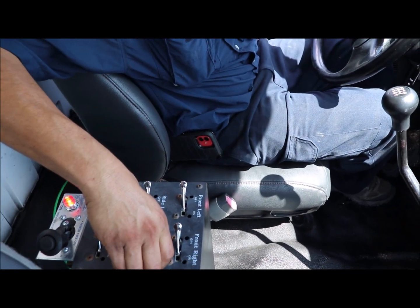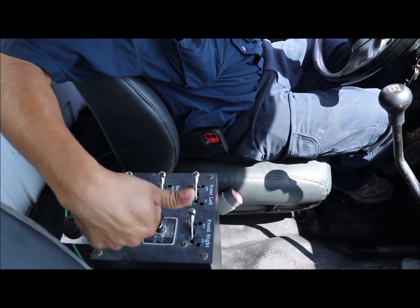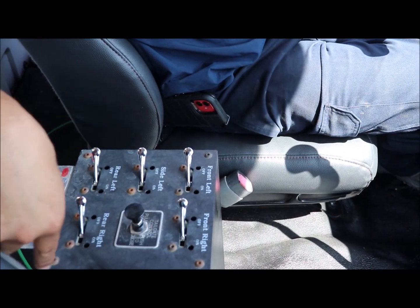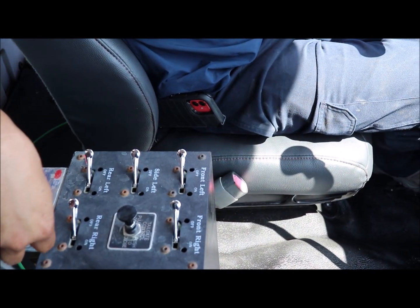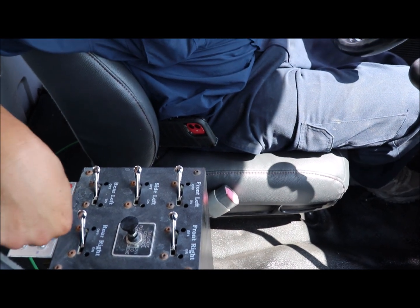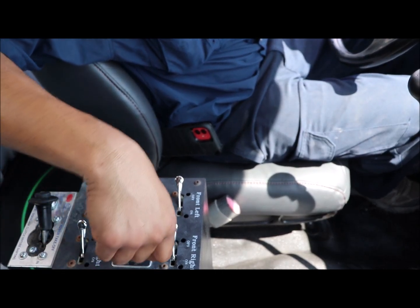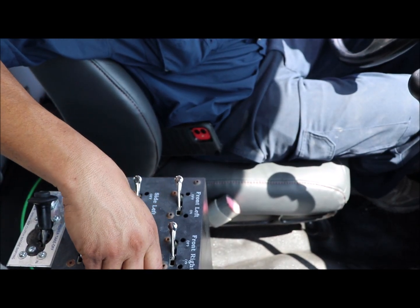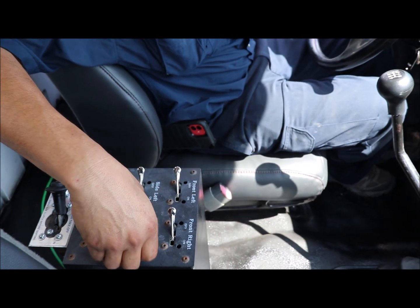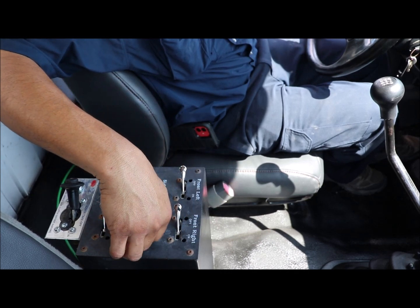Your tailgate itself is basically your gravity bar. For this one, you don't have to have your PTO engaged. So to disengage your PTO, push on the clutch again, and then go ahead and turn it to the out or off position. And this can work basically just manually, just by gravity. It doesn't take any PTO force or any pressure to open up. It's just by gravity itself. So we'll see the system work right now.